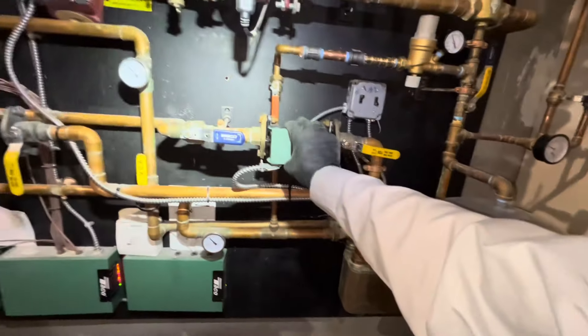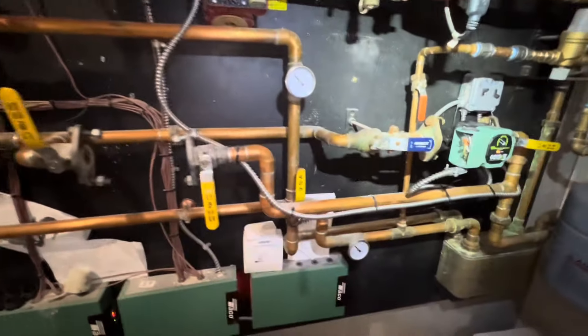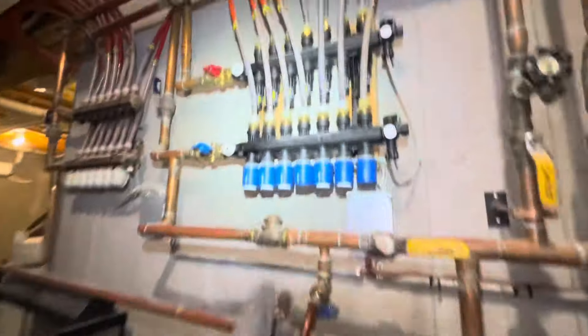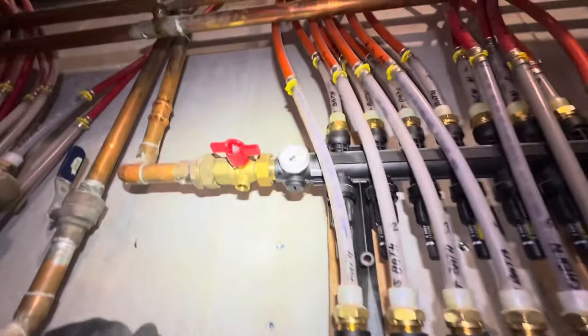I've been here for quite some time. Here's the overall breakdown: I was able to replace this circulator. However, there is no means throughout the whole system — in the pipes above or the pipes that come back to the boiler — to purge. I was able to purge through here with the circulator on: you can pull water and bleed it, which worked out nicely. For circulating temperature, we hit up to 160–180 degrees, whereas before it was hovering just below 140. That now means our radiant manifold is getting a nice hot temperature, where prior it was only getting about 90 degrees.